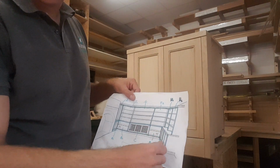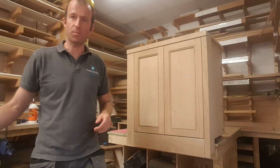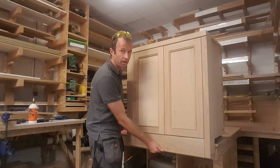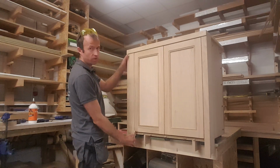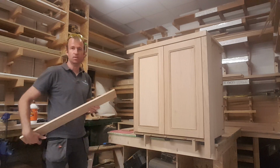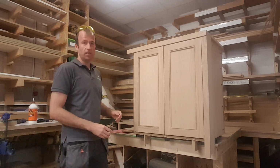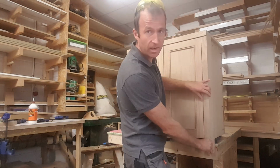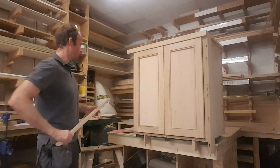We want to have individual strips between the doors rather than doubled up. So we're relying a lot on the Domino, so everything is just slotted on accurately, and the Dominoes keep that position, because these of course we now want to stain up, and I'd rather stain them individually than stain the whole thing as an assembly, because I'll get a better result staining them individually.